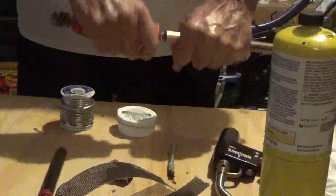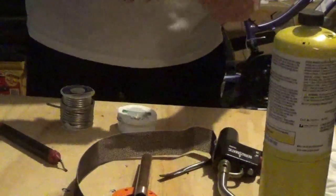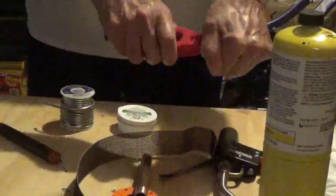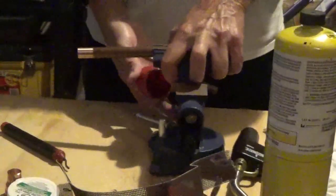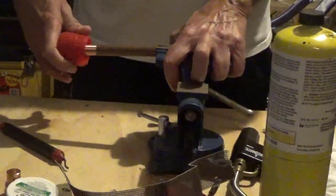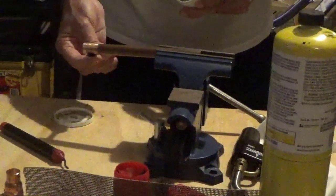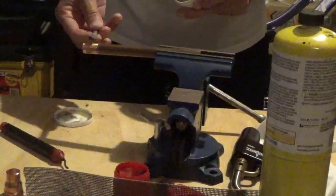There I'm cleaning the inside of the pipe. And this is a deburring tool — in case you make a cut, you want to make sure there are no burrs inside the pipe that might affect the soldering process, whether now or in the future.